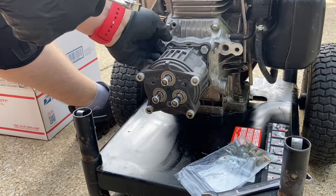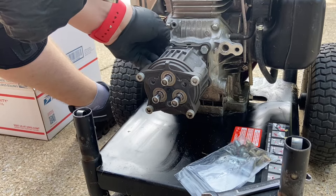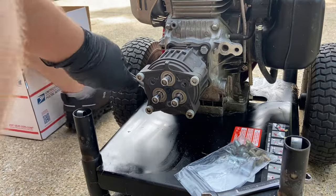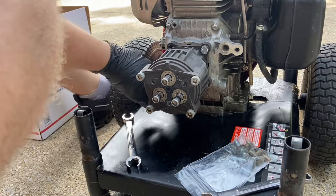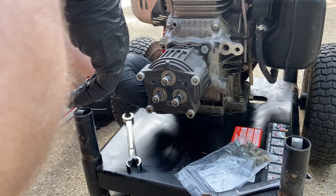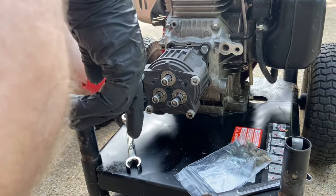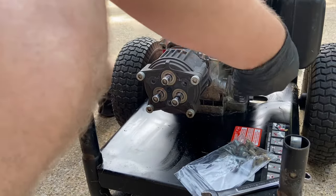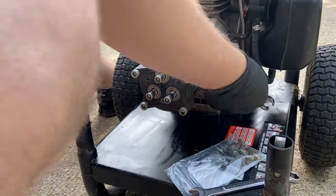The thing that kills me is I had those valves before. It probably needs all six — when you buy the kit, it's six valves. You can also buy the seal kit. In my experience, those valves melted because it was being run and water wasn't flowing through the pump head, so it wasn't cooling down. A lot of times when people do that, it also damages the seals. So you should really replace the seals and the check valves.